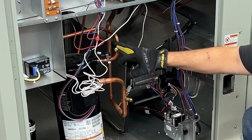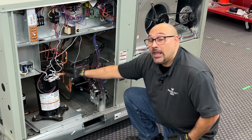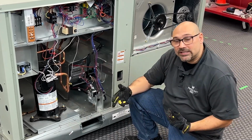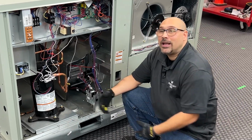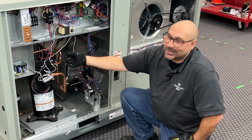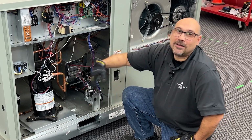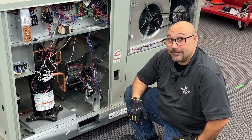Otherwise, if it's not the first time you're there, you can always go with temperatures and ambient. Then if you start to see a problem, you can gauge up. I always tend to stop gauging up as much as I possibly can, because each time you do that, you're pulling refrigerant out, you're depressing that Schrader valve, which gives you a possibility for leaks.